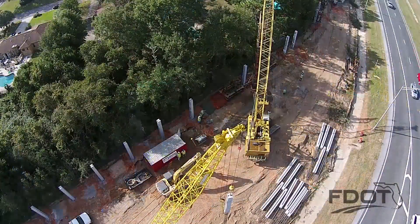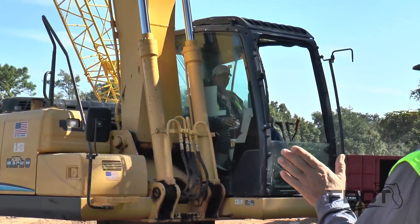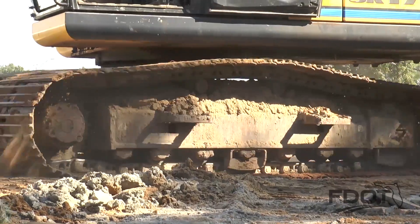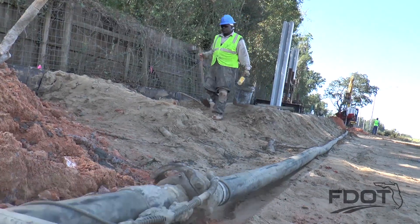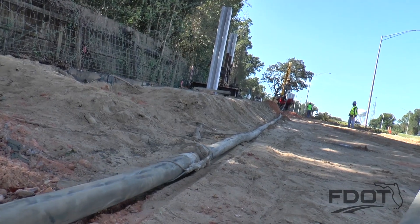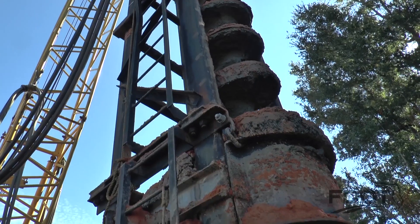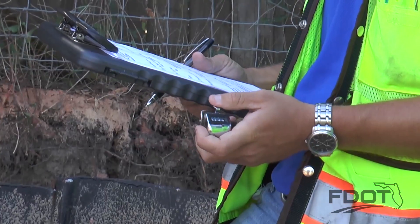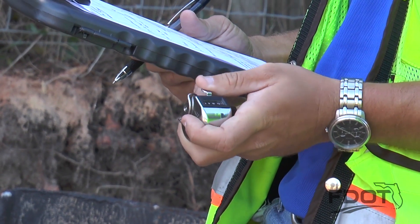Next, on to the grouting process. The superintendent, foreman, inspector, and crane operator gather in close proximity to facilitate communication. Strokes are counted and recorded. Pump pressure is monitored using a gauge on the hose. The 5-foot head of grout is completed first before raising the auger. Once the 5-foot head is established, the crane operator will raise the auger at a slow controlled rate. Stroke counts are continually monitored to assure the correct quantity of grout is pumped into each segment that is marked on the leads.